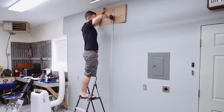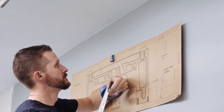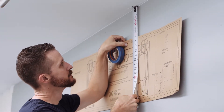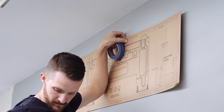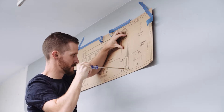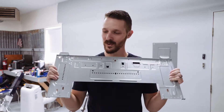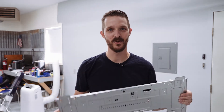If your ceilings are nine feet tall or greater like they are here in my shop, you want to mount your indoor unit on the wall 90 inches or so from the floor. You're going to want a minimum distance from the indoor unit on the wall to the ceiling of at least six inches. Once you've got your template in the right place, go ahead and use a screwdriver or a hole punch or whatever you have on hand to mark your holes. I also used a Sharpie to label the holes — whether I'm going into a stud, whether that's the place where I'm going to use the hole saw to drill the hole for the lines, or if I need to use a drywall anchor. Everything is ready to go. Let's get this sucker on the wall and drill the hole for the lines.